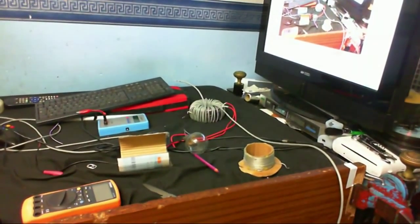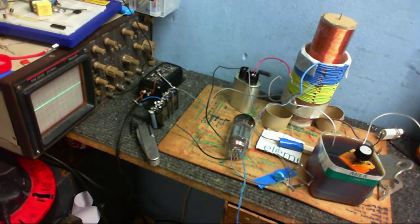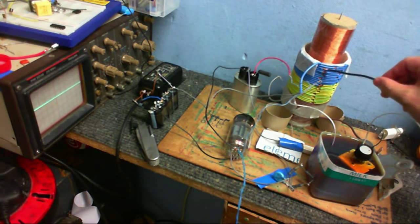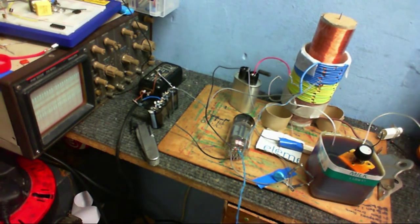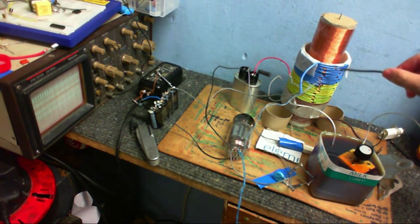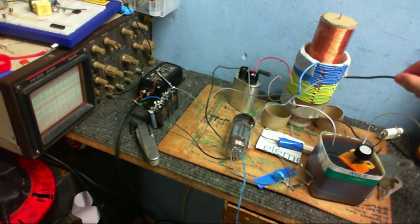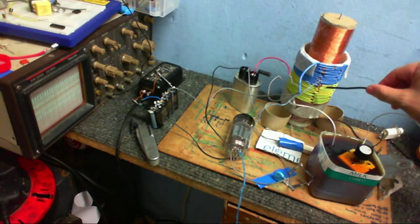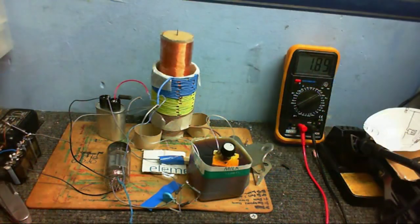But I've got a transformer that I'm working on that hopefully should power that up. So anyway, let's do this again. This is without any capacitor whatsoever, and what I'm going to do is attach this capacitor to the various taps on the coil so you can see what happens. So this is the waveform on the scope at the moment and it's oscillating at a very high frequency, which it shouldn't be doing. As I go down, on this tap here, the frequency goes down a bit but also the amount of output goes down.